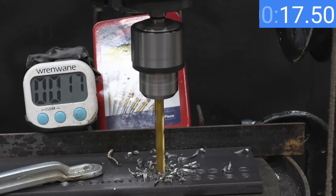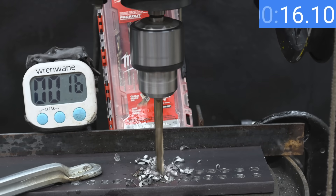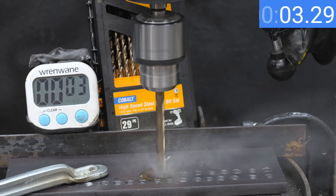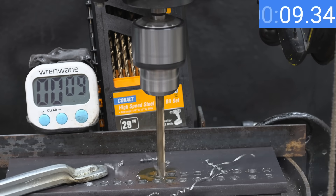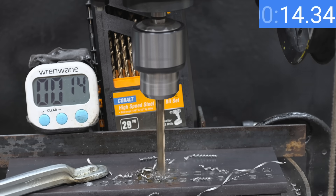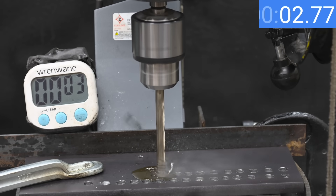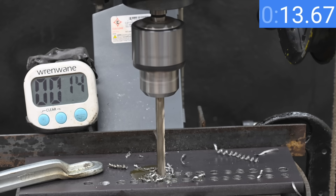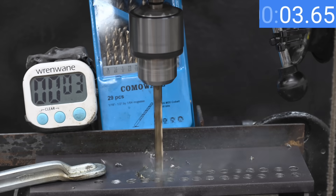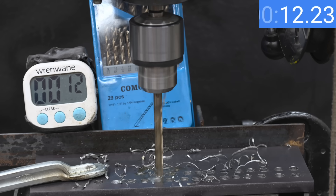The Milwaukee Cobalt made quick work of mild steel and spring steel but has lost quite a bit of speed — 17.19 seconds. It's very rare for a product to experience damage that doesn't show a noticeable performance loss, but the Warrior experienced a very large chip that left behind an edge still performing very well — 15.79 seconds is almost as fast as the first attempt. The Cleeline drilled through mild steel in 10.99 seconds the first time, but lost quite a bit of speed, finishing in 15.53 seconds. The Come-A-Wear drilled through mild steel in 11.2 seconds last time and showed very little wear drilling through spring steel — 12.7 seconds is good enough to move into first place ahead of the DeWalt Cobalt.